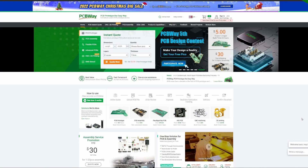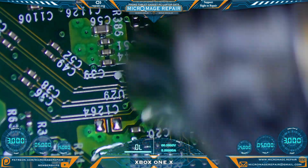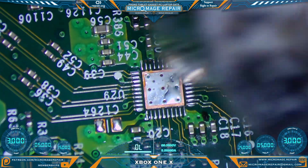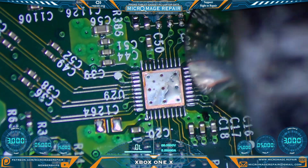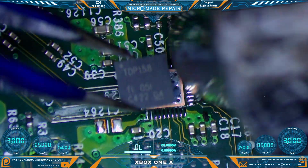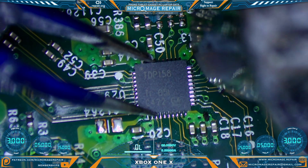When replacing the chip, I'm looking for that center pad to wet. You need the center pad to wet so it can grab onto the chip. You do not want to let go of the chip until it has grabbed on. There we go — nice and shiny, let it grab on.